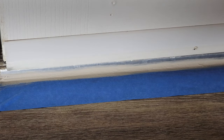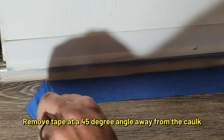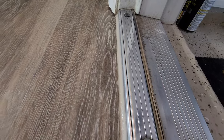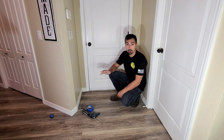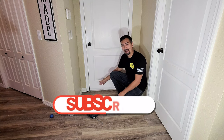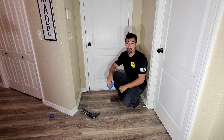All right, so next thing — this is the cool part — what you're going to want to do is don't let that dry. As soon as you're done and you're happy with that bead that you put down there, you're going to take the tape and pull it back at a 45 degree angle. There you have it, quick and simple. Anybody can do this and it'll turn out like a pro did it. Painter's tape goes a long way and anybody can make a nice clean edge between a threshold and a new floor that was just installed. So until next time, guys, thanks for watching. I appreciate you. Stay handy, my friends. See ya.